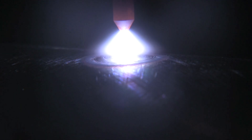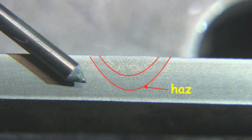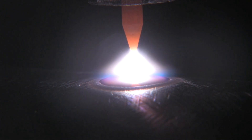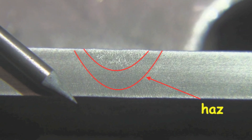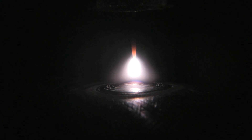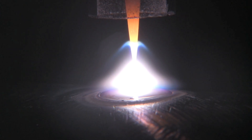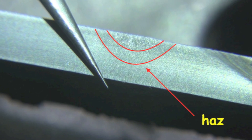Let's get another quick look at these arc starts — I'll just puddle here momentarily to remind you what things looked like. The arc cone on the first was pretty narrow, and that was the result. On the second electrode, a little more taper, a little wider arc cone, a really crisp start, and that yielded this weld nugget. The last one has a really weird halo coming out midway — I think that's because the temperature of the electrode is getting really hot in that area and something's happening differently than on the other electrodes.